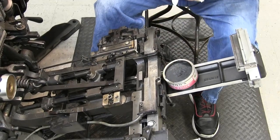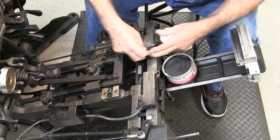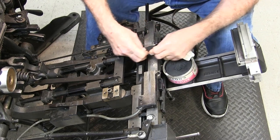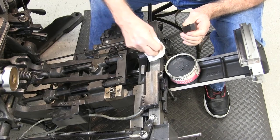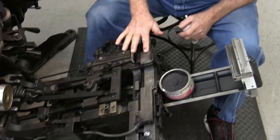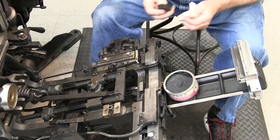Get a little bit more polish and on this jaw hold the block as square as you can and polish up and down to get any metal that's adhered to it. Now if there's a lot of metal on there and you haven't cleaned them in a long while, you can take a razor blade, hold it flat, knock the biggest part off, then finish up using your mold polish.